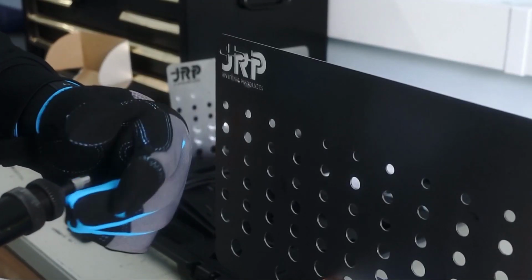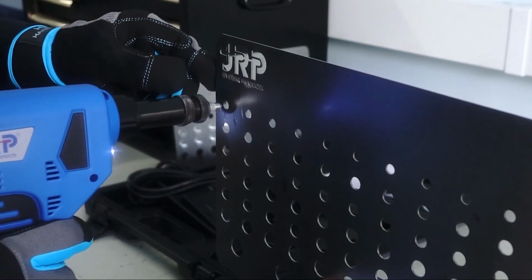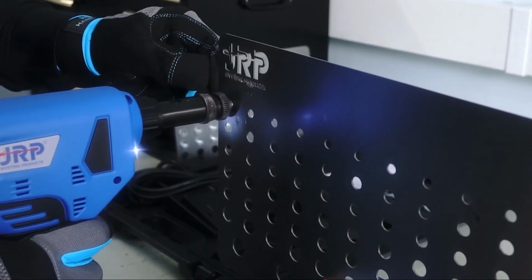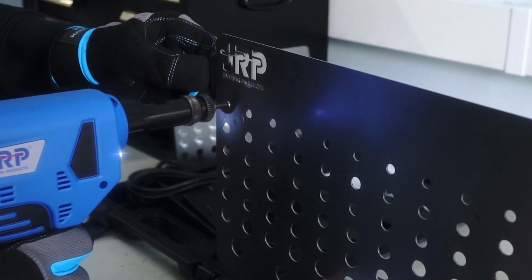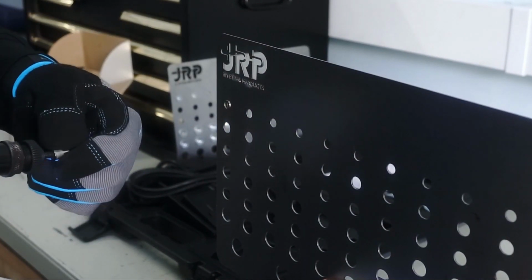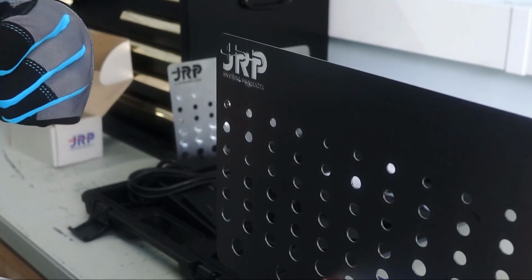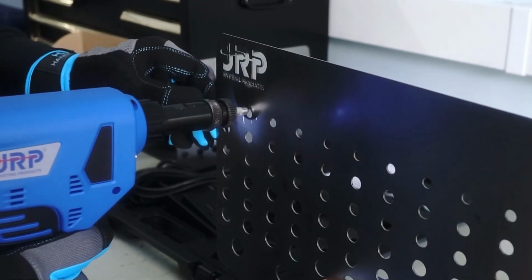To operate the tool, it is pressure sensitive on the mandrels, so you screw the first thread to avoid cross-threading. Push the rivet nut and it winds onto the front face and locks off. Pull the trigger and the rivet nut sets and spins off to give a final setting. The tool is then ready for its next action.